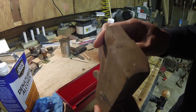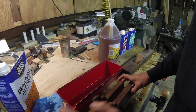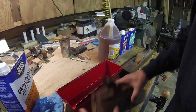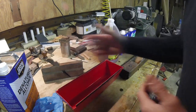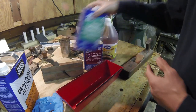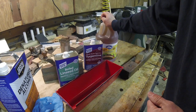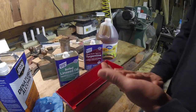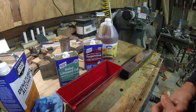I've already cleaned up the irons. One of the groups I'm a member of on Facebook deals with old tools, hand planes, and restoration. The guy recommended - he claims he does all his tools with linseed oil, turpentine, and cider vinegar. I'm going to go with equal parts and we'll see what happens. These two together probably cost me five bucks, so I don't have much to lose. Nothing here is really going to ruin them - it's just whether the final quality is what I'm looking for.